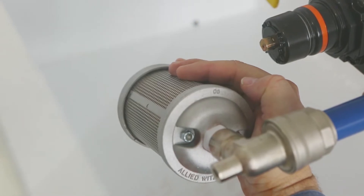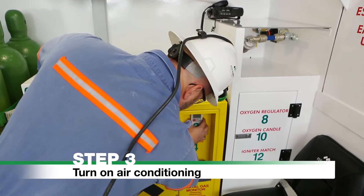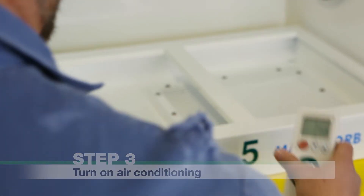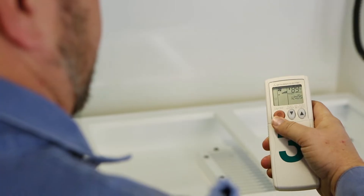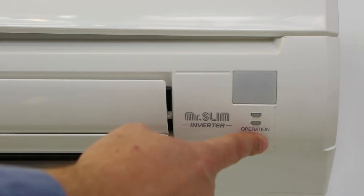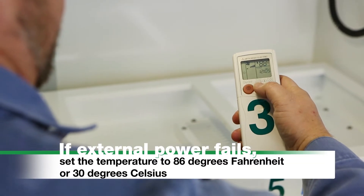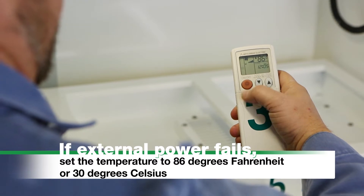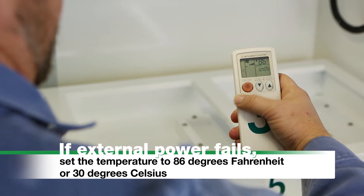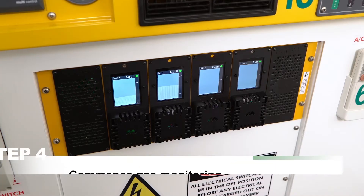Place hand over the auto muffler to feel for airflow. Step 3: Turn on Air Conditioning. Turn on the air conditioning system using the remote control. Or, to start the air conditioner manually, press the EO SW button. If external power fails, set the temperature to 86 degrees Fahrenheit or 30 degrees Celsius using the remote control.